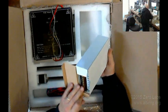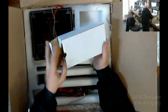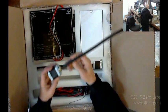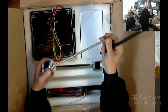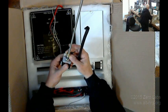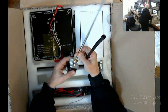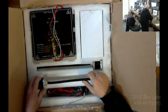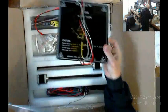This must be the power supply — a fairly beefy power supply for the printer. This is one of the main features of this particular 3D printer that I selected: it's a lead screw stepper motor, meaning the lead screw is permanently part of the shaft, so there's no backlash on the Z-axis. That was one of the selling features of this model, and that's what gives it the 100 micron resolution that a lot of other similar-looking ones didn't have.